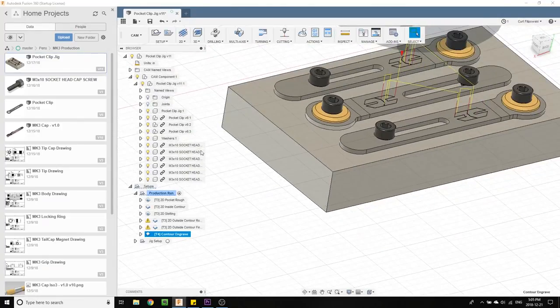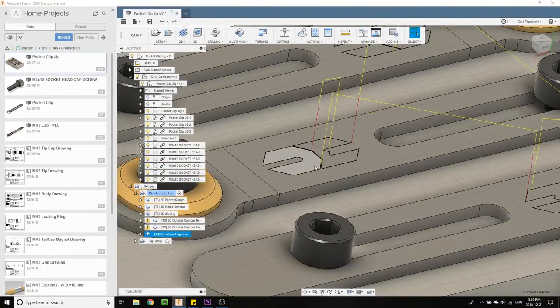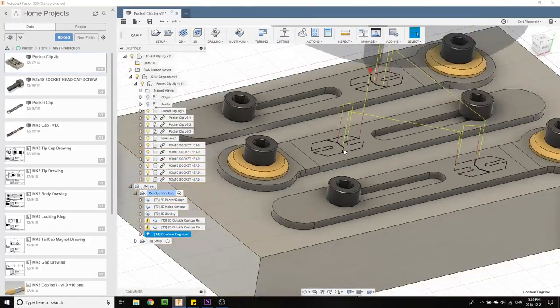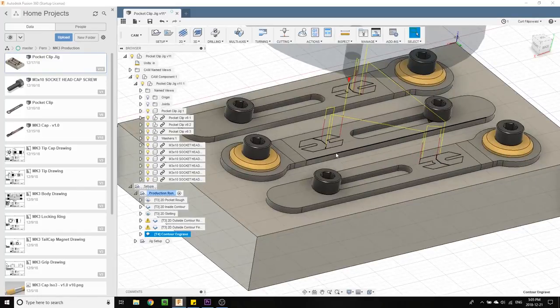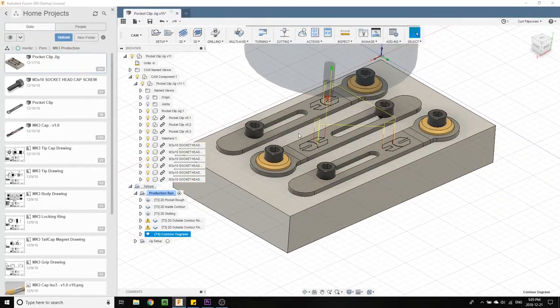The last step is to come through with a pyramid style engraving tool — the same one I used in the past — and engrave my logo right into the part. I messed up my offsets a little bit so the engraving came out way deeper than I wanted, but I don't mind the look of it. I'm really impressed that little pyramid style engraver didn't just die with that kind of plunge into stainless — it cut quite well, so I might actually design that to work properly next time.